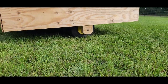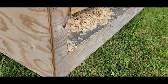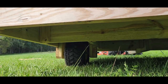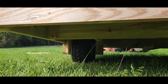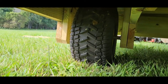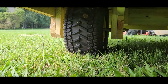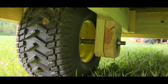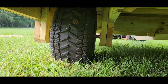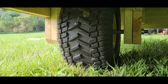I had some extra tractor tires and I bought some steel rod and built that on a frame. All you gotta do — you can get whatever's cheapest, 2x8s, 2x6s — build your frame out. I dropped the tires down, and you can see here how I put it vertical and then horizontal. So if you put a lot of weight on this thing, it won't split. On the end there, I have some collars that you just tighten up with an Allen wrench, and it'll lock that wheel in place. Over that steel rod, I put a greased cut piece of conduit to hold it tight in that position.